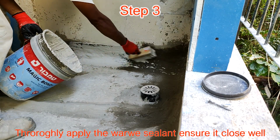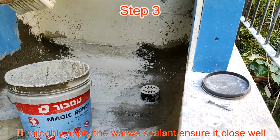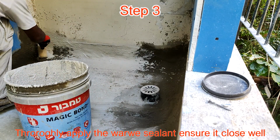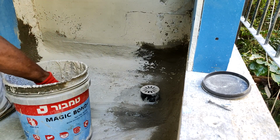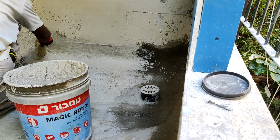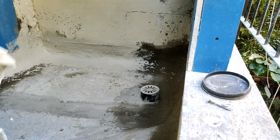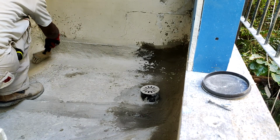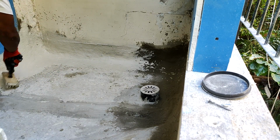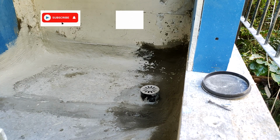applied on the pores, openings, the tiny micro pores. You must make sure you use the sealant to close them, because what you want to avoid is water moving from this floor down to the rooms underneath and causing problems on the deck. So you must make sure you prepare the wall and then use this sealant to cover everywhere. Sometimes you will cover the walls too, so that the opposite side of the wall will maintain the paint. Otherwise, the paint will also have problems.